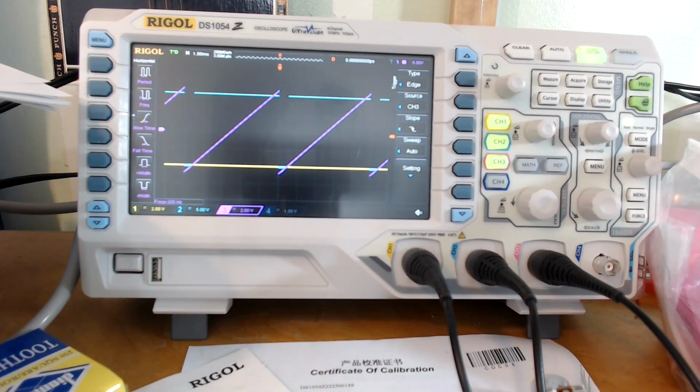And as I said, I don't know why it shuts down at a non-zero or non-100% pulse width, but whatever the reason is, it happens, and I don't know a way to make it not happen. But obviously, if the voltage at the end of the pot is not large enough to get you to the shutdown region, if you're being constrained like that, well, you could increase the voltages on the ends of the pot to increase the pot limits and get yourself further to the point where you reach the shutdown. So then you're not constrained by the pot limits.